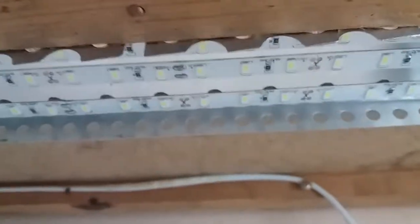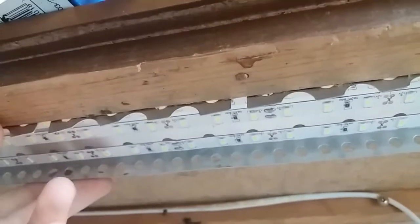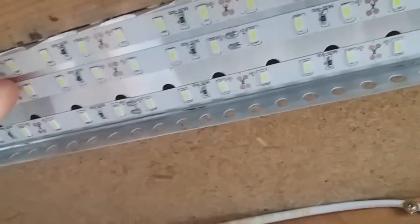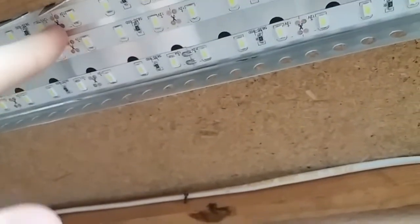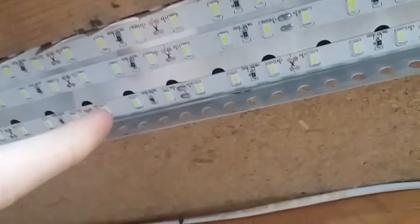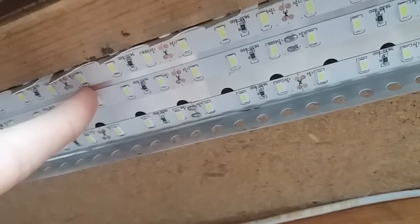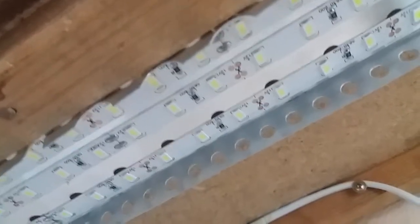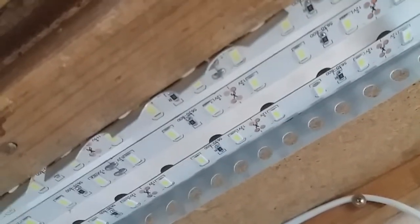The problem is that this transformer would be perfectly fine for about 12V, 1A — which may not sound like much, but it's roughly 5V at 2.5A. For the size of this transformer, which just fits on a fingertip, it's awesome. But I had to redo the transformer. I used a bigger core because I want to drive this LED light. Under this shell I have an aluminum piece to which I stuck three strips, each 155 centimeters long. I have no idea how many inches that is, sorry. It draws about 1.8A at 12.2V, so it's a reasonable light. It heats up quite a lot.